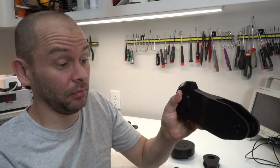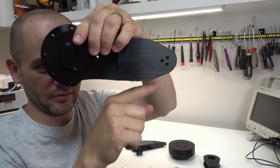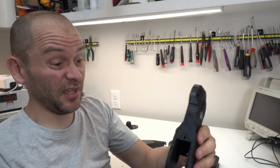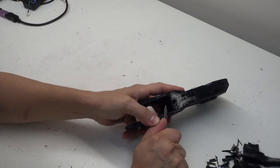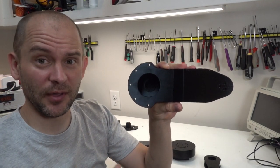All the while, these plastic parts with lamination lines have to not fall apart. Prints are designed in obnoxious orientations that require a fair amount of support in order to get the layer lines going the right way. For this upper leg, for instance, it's printed in this orientation with a bunch of support in the middle, printed in one piece. It still takes a moderate amount of time to remove all the support. There's also a bearing interface — since it's printed in an upright orientation, the circular bearing interface is never quite perfect, so you have to whittle that to get the bearing to be a snug fit inside.